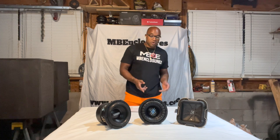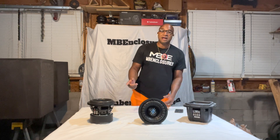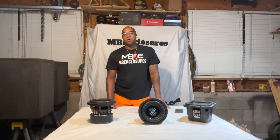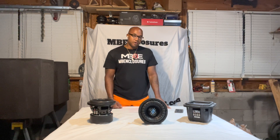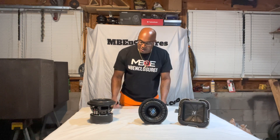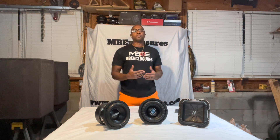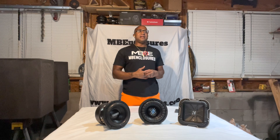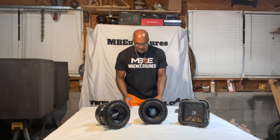Put a cup of water — which one of these would you rather pour water into? Pour a cup of water in this Sundown and come back tomorrow, or pour a cup of water inside this Kicker and come back tomorrow? Which one is going to lose some of its rigidity because of being exposed to water? Of course, the paper cone. The larger brands know that you can get a given weight and a given strength by using polypropylene. There's a myth that plastic doesn't sound as good as paper, but even the higher-end lines use it.